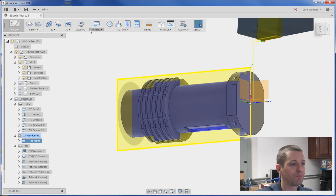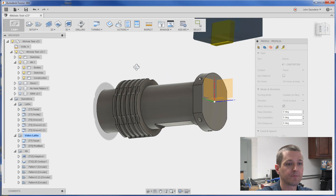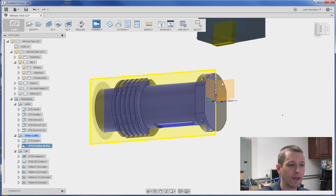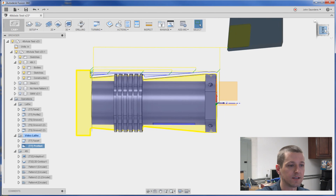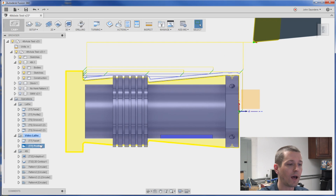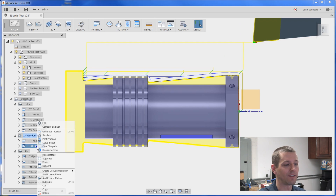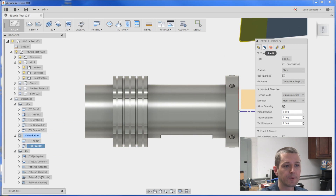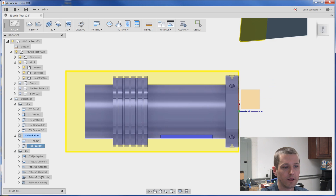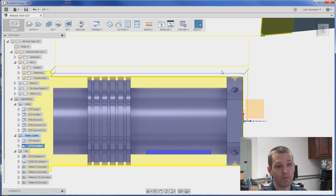Turning or facing is real easy. Turning profile — same tool, tool seven, so let's just click okay. You'll see what we get is it's trying to profile in how it can, which is actually a really cool feature, but I don't want to do that — I just want it to profile the outside. So we'll go back to edit, and under the first option here, see this 'allow grooving' — turn that off. Click okay. Much better.